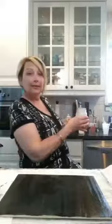So, oh gosh, I got to show you though. Look at how pretty that side is where we did the stained look. Gosh, that's cool. It looks a little bit dry right now, but that is because milk paint has a drier texture once it dries, and then it has to be sealed. So unlike the Miss Lillian's No Wax chalk paint that has a sealer, this does not. So this does need to be sealed, and you would not want to seal it with shellac because that would be a hot mess. But you can kind of see, if you put a sealer on it, how pretty that stain side is.